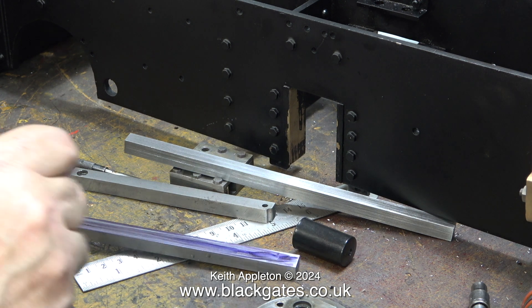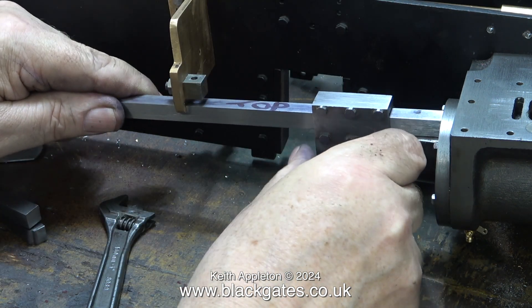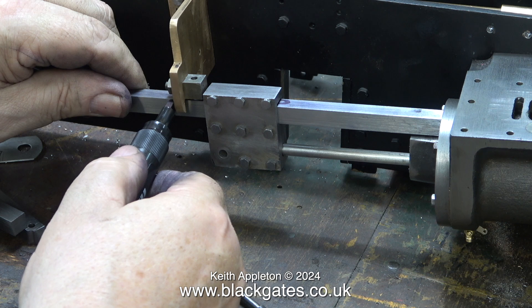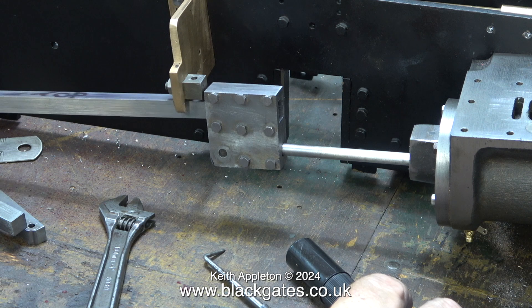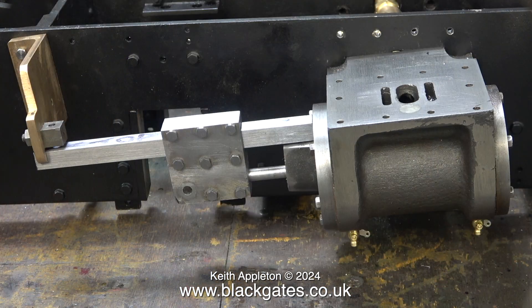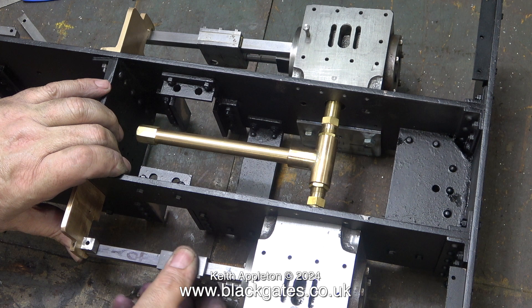Because the central part of the crossheads aren't milled they are not accurate. The left hand side was okay but the right hand side needed a bit of help — to make the right hand crosshead guide fit inside the crosshead slot I had to remove a little metal from each side. The crosshead guides hadn't been cut to length yet, so after marking them with a felt tip pen I put them in the bandsaw and cut them to length, leaving them slightly oversized so I can machine them accurately. This is a good fit side to side with a bit of a gap top to bottom, which will be filled with a shim. Brass isn't a good material for shims because it doesn't wear very well, but it's a sacrificial part and very easy to change. You can machine proper shims using pieces of gun metal, but in this case I'm going to leave it as it is.